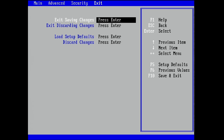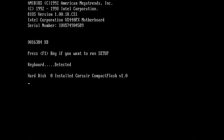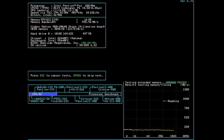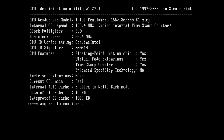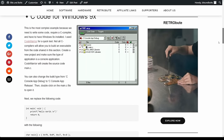Let's quickly see if we get a different performance result in SpeedSys — and then we'll try if the F00F bug is present on this CPU; it shouldn't be, but I want to test it. The score looks almost the same as before. Now checking the CPU tool by Jan Steuniebrink: Intel Pentium Pro 200 — internal L1 cache in writeback mode, 16 kilobytes of level 1 cache, and 1 megabyte of level 2 cache integrated. So let's see if we can create our F00F bug.